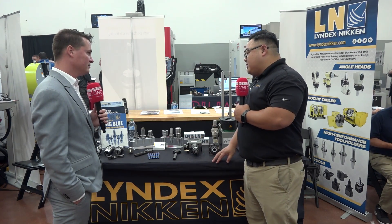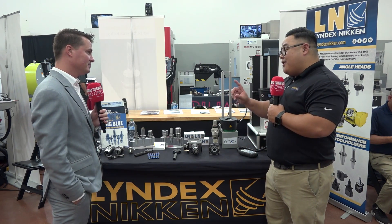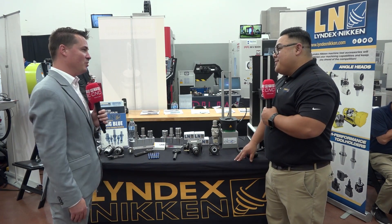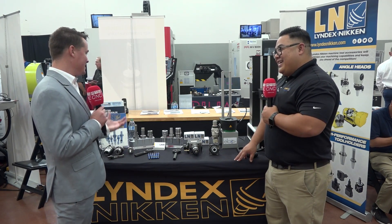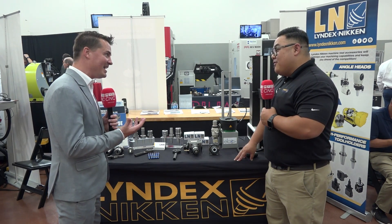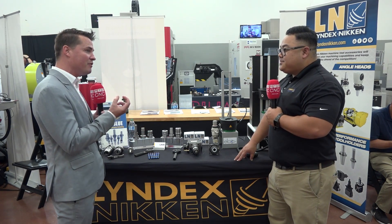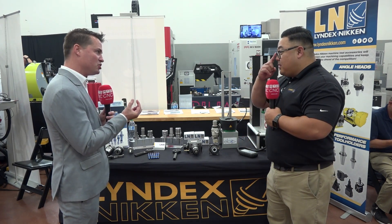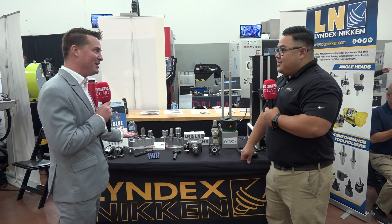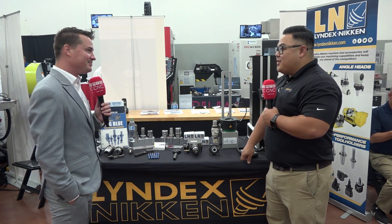You need things to be symmetrical and as smooth as possible. Those holders boast a guaranteed two-tenths TIR at four times diameter — every time. Really impressive. I worked in the high-speed machining world up to 90,000 RPM for quite a while, so this technology always fascinates me. Spinning that rapidly changes the way we think about machining. We must have higher RPM when we get into smaller diameters, based on surface footage — a five-inch face mill versus a one-millimeter tool going 40,000 RPM. Great product.